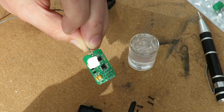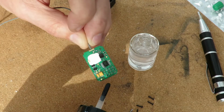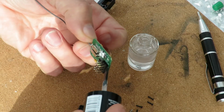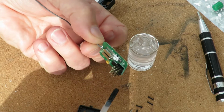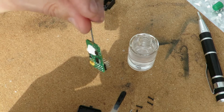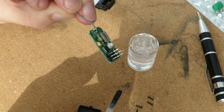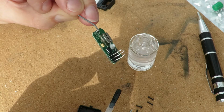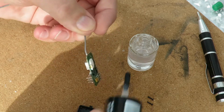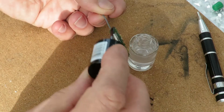So I'll just say that again, the place that I've found problems isn't any of this, it's underneath those pins, right underneath the black plastic bits. The water gets under there, then when you've got the current flow, that creates the crystals that grow up underneath. Probably put far too much on there now.